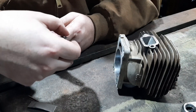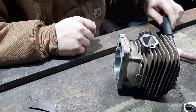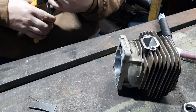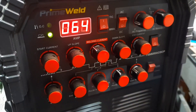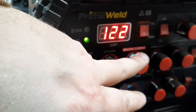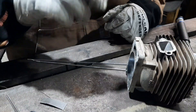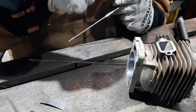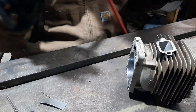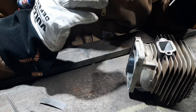I've been using the purple band tungsten — I think it's a tri-mix. It's been treating me pretty well, but I'm still pretty new at all this TIG stuff. Get our filler rod, trim it down a little bit. I'm going to switch to AC — now about 125 amps, now we go 130. With AC current it goes both ways through the metal: it'll go in and come back out, and when it comes back out it pulls all the impurities to the top. Cleaned it off pretty well, but it is a casting — castings do weld ugly. It's been a while since I've done any TIG aluminum, so this may be ugly but we'll see what happens.